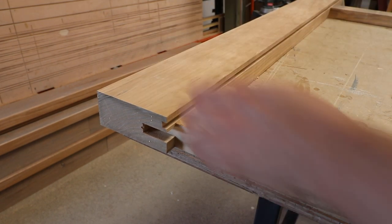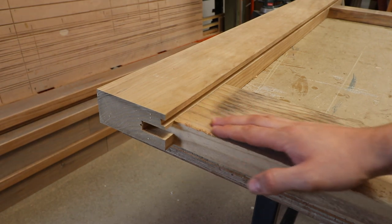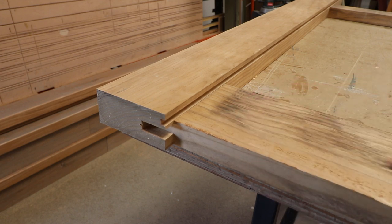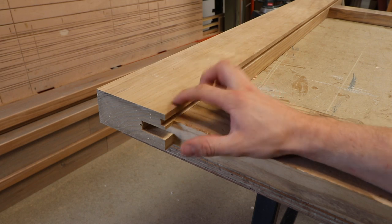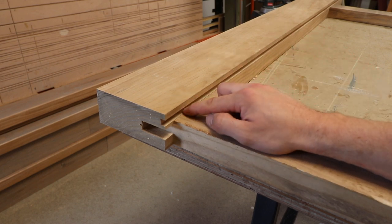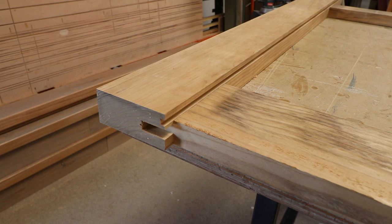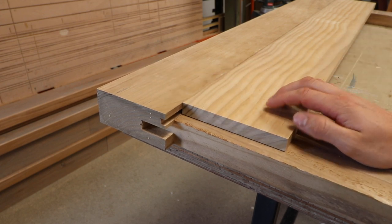This gate is only loose, it's not actually glued up. But ignore the roughness here - if you've planed your rails up and it's a bare-faced rail where the boarding's going, you can lose some roughness like this against the boards and have a nice clean face for the outside. The style is the upright of the door at full thickness, and the rail is called a bare-faced rail. It runs into the style less the thickness of the boarding you're going to be putting on the door, so everything is flush across the door and the boarding will match the style.